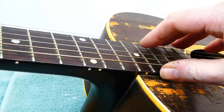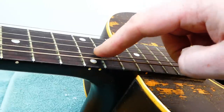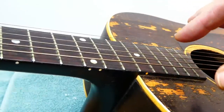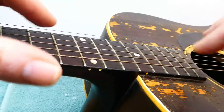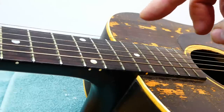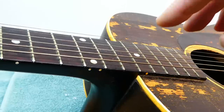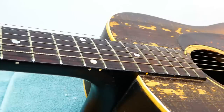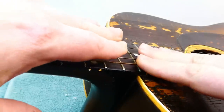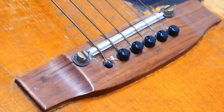If I heat up the extension and it comes apart, I'd pull out the 12th fret, get out my fret saw, saw through it, remove it, then glue those two parts together, flip them over, and route a slot for reinforcement on the underside. I'd make a little filler piece for the saw kerf and glue it back onto the neck. The problem with having the joint right above the body is you're relying on that tiny bit of end grain to stand up against all the folding forces of string tension.